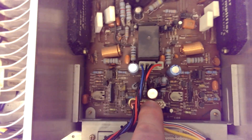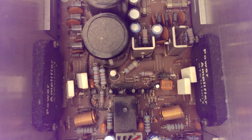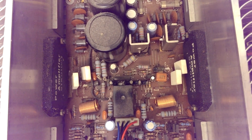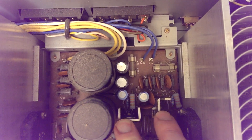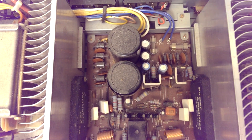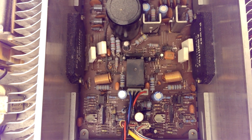This cap here, which appears stressed because it seems to have stretched its label, is the timing capacitor for the IC over here. That IC controls the protection circuit and the turn-on delay — if that cap fails, this thing will appear like it's going into protection. I'll replace these caps; they're in a hot location next to these shunt regulators and these large amplifiers. They're cheap, they're in hot locations, they need to get gone so we don't have problems.